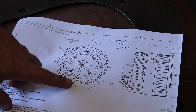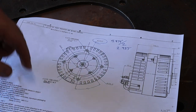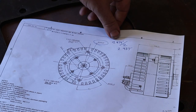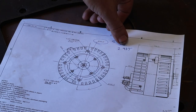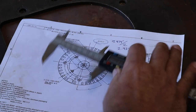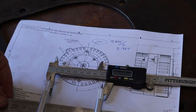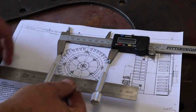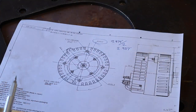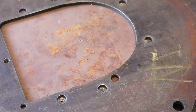According to the drawing of the motor, the outside ring of holes has a diameter of 149.2 millimeters, which is less than six inches. Dividing by two gives a radius of 2.937 inches — a weird size. I set that measurement up on my caliper and then matched my compass to it so I could draw a circle from our center point.